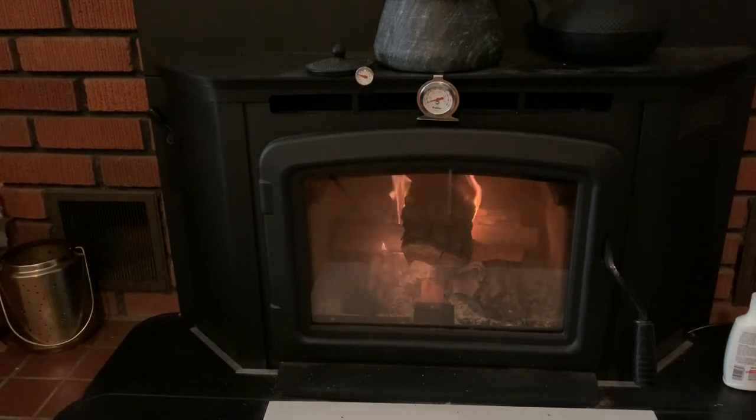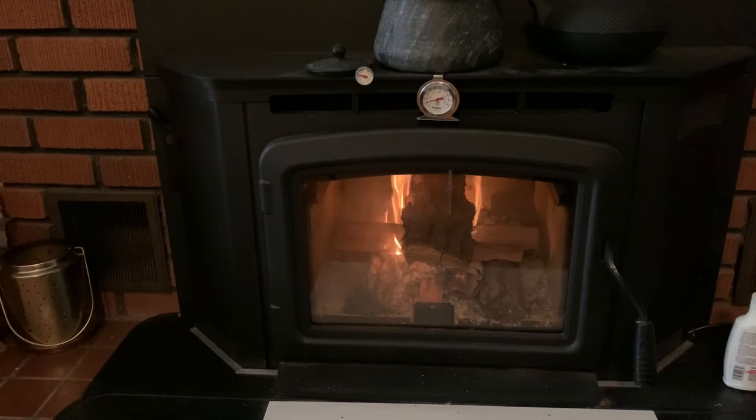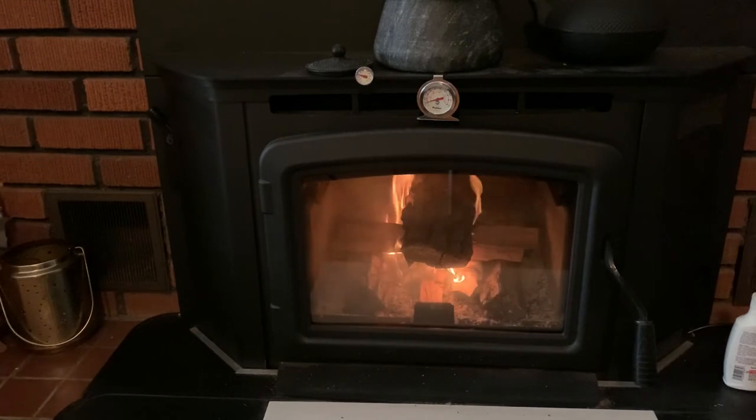As the fire progresses, you're going to hear the stove make all kinds of clickety-clackety noises — that's the metal expanding in the stove. My thought is when it reaches a certain tone, that's when you close down the handle and cut off the extra air going into your stove. You have to use totally seasoned firewood in these stoves. You can't be putting anything in there that's 30 percent moisture content — it's got to be below that. Once you get the coals burning and the stove heats up internally to a certain temperature, you can put just about anything in it, but it's not a good idea because whatever you put in is going to come out the other end as creosote. So try to get wood as dry as possible.